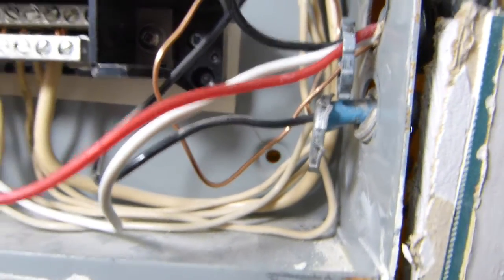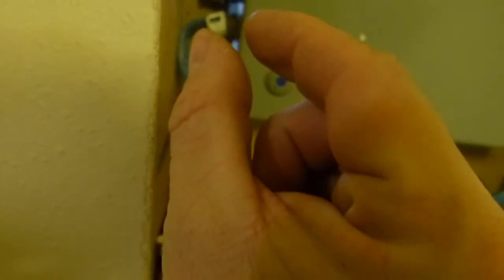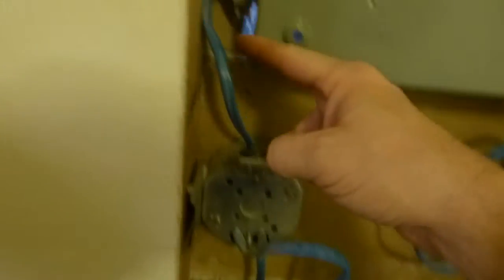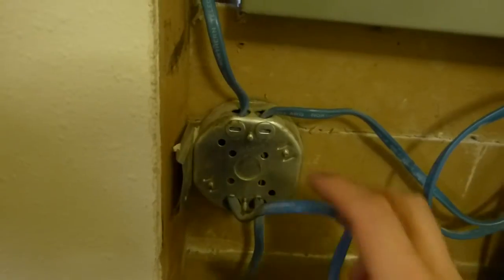On this breaker panel, because it's being replaced, we have the rare opportunity of following it and looking at the other side in the laundry room, where we can see what it's actually doing as it exits. Here we have even more blue wire. You can see this jacketing is from the mid-80s — that's when these wires were placed in here. This suspicious-looking bit of blue jacketing verifies there are more problems with this circuit. You can see that out of this junction box there's one wire exiting, but another three leading into it. Why is it three into one? It's illegal, it's abnormal, it's not usual, customary, or sane. Usually every wire should have its own breaker.